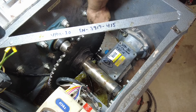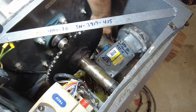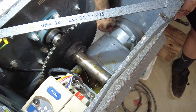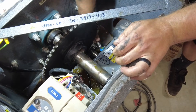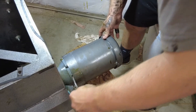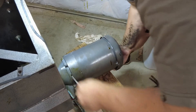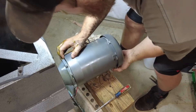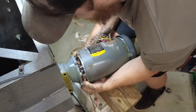Now I need to get at the housing bolts right here - there are four of them that go all the way around so that I can split the motor from the gearbox. I'm going to try to break them loose. It's nice - I see they have spots to put a pry bar in to pry this apart. Now I'm going to try to split the motor from the gearbox. I'm just going to wiggle it free. There we go, it just popped loose. Motor is out.